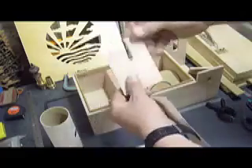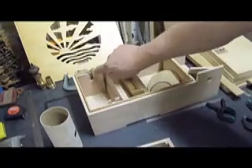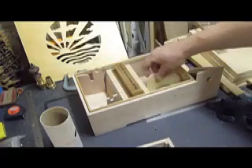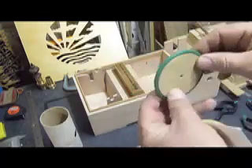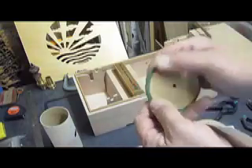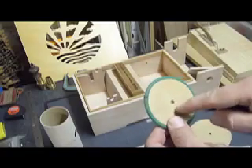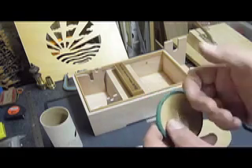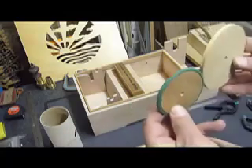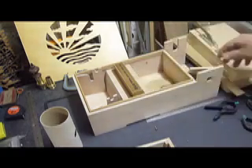Inside I have made the side cheeks that support the roll of music — the tune to be played — with a slightly raised peg to put the roll in when it's rewind time. They've had strengthening strips added to them. The drive wheel has been made, and the idler wheel has been made with its groove. I've now added the drive band or drive belt, which is made from rubber available from a sewing machine shop. You can buy this rubber for next to nothing in metre length strips, cut the length you need, turn it into a loop, heat the ends with a lighter, and push the ends together — they simply melt together to give you a drive belt.